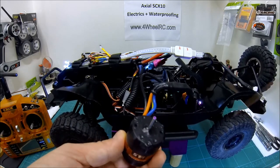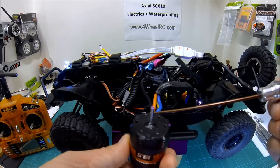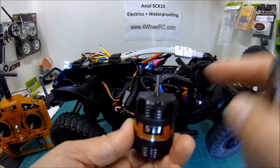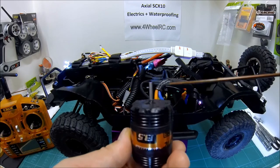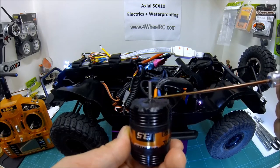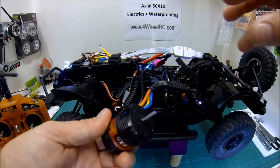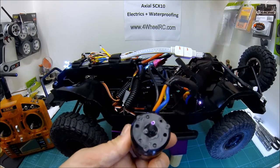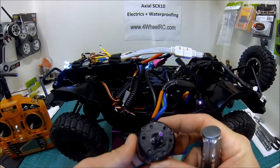The bearing here on the inside of the motor has got marine grease on it, and also on the outside. I've put marine grease around there, and then with my finger I've just rubbed around and made a cone of marine grease, and then I've put Plastidip all the way around, so we've got a very slightly soft dome of Plastidip. What I'm hoping will happen is when that goes underwater we'll get reasonably equal pressure on that area, which will hold the marine grease on the bearing and stop any water getting through.